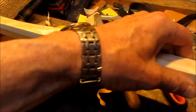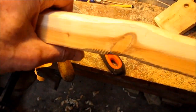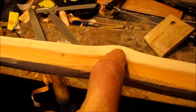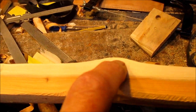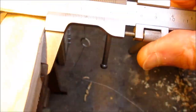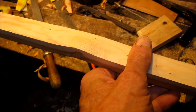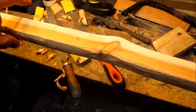I've been working on this, getting it a bit narrower and straighter. We're still not down to the target of 25 millimeters, but you can see where I've removed wood off this knotty edge - I've now got a lot more sapwood showing. That means I can reduce some of this sapwood where it was over thick, but before there was only a whisker of sapwood. Width-wise we're at 29 and a half millimeters, so a fair amount I can take off still. I don't want to rush and take it down too early. I've been thinning it from the belly and from the sapwood side.